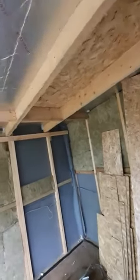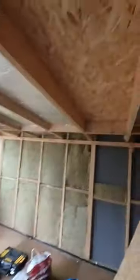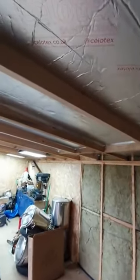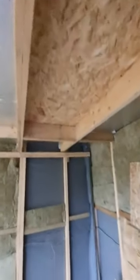I've discovered I could really do with sticking up some of this insulation. I stuffed it in there — it feels like it goes well. And then we even put foil tape on the edge to seal it. Vapour barrier and stick it up. But it doesn't stick great to this timber, so I'm going to have to put some adhesive under some of them. So I've got this one here I just stuck last night.